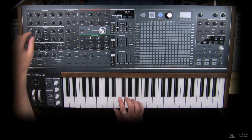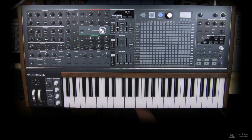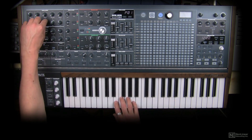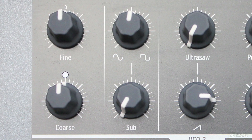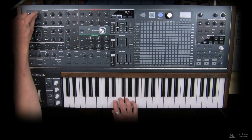In addition to that, we also have a sub-oscillator. The sub-oscillator is a situation where the waveform's frequency is divided in two to create a waveform that is an octave lower in frequency than what the oscillator is set to, allowing you to create a bassier sound. It can be used in tandem with the waveforms present in the oscillator or by itself. You have the option of using a sine wave or a rounded square wave, or any combination thereof — it's continuously variable with this knob here.